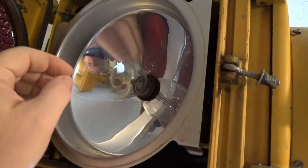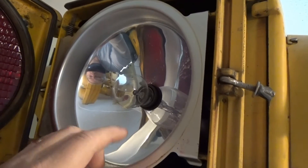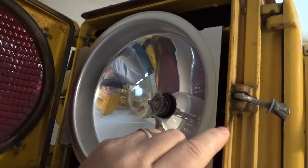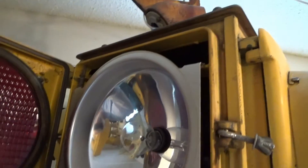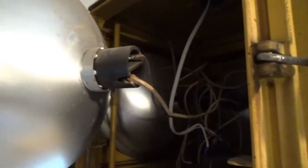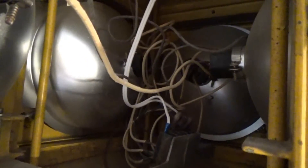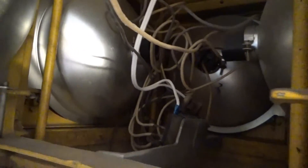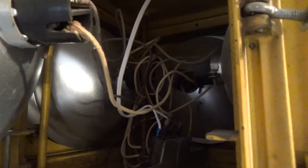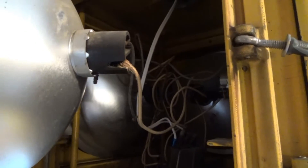You have the reflector here and a lamp in the middle. Normally there would be a traffic lamp — a 67 watt or 69 watt traffic lamp. This particular lamp is a 40 watt appliance bulb; I've been lowering the wattages on the lights around the room so the electric bill doesn't go sky high, and it's dimmer so it's more pleasant to look at indoors. The reflector pops off and on the back side you have your wiring — a socket with wires leading to a terminal block, either screw terminal or later ones with spade lugs. Depending on how the circuit is wired up, all four lights could light up at the same time, or in later years the circuit would be divided into two sets so opposite sides would flash sequentially back and forth wig-wag style.